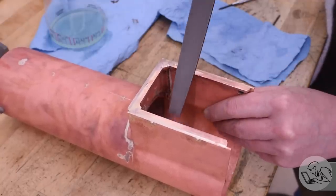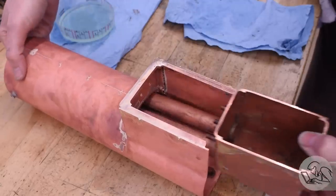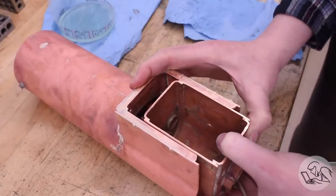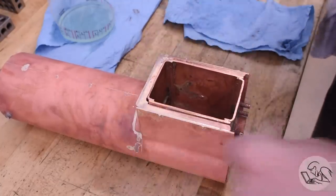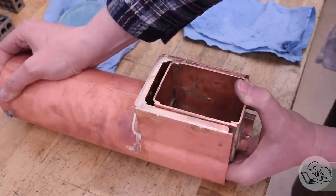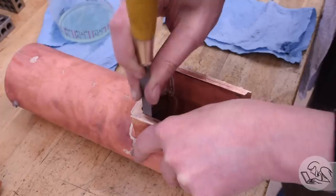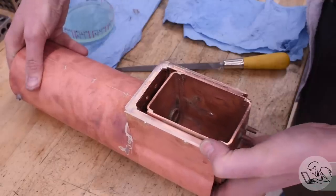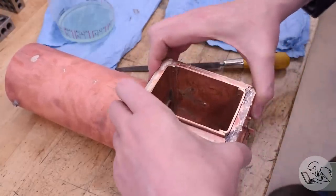Obviously I need to fix the throat plate, but there's an opportunity for that later. Right now I'm going to continue focusing on the foundation ring. Kozo recommends filing a chamfer on these inside corners here to help the solder flow into the firebox side of this joint. Then I can fit the firebox in here once again — I've got to make sure everything is still fitting the way I think it is before I move on. And the answer is no, it is not. The soldering of the foundation ring has put little chamfers and such in some of my corners that were so carefully fitted, so I need to clean those up and resharpen those corners a little bit. I did some work with a triangular file and made everything fit really nice and tight once again.